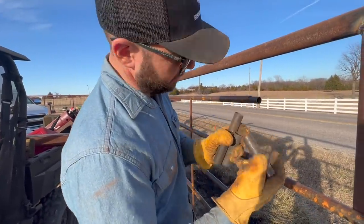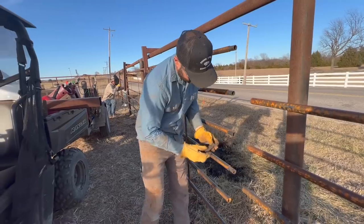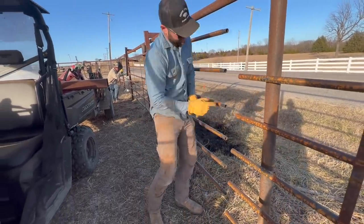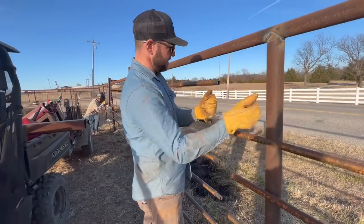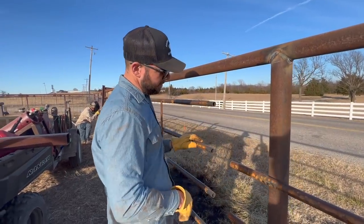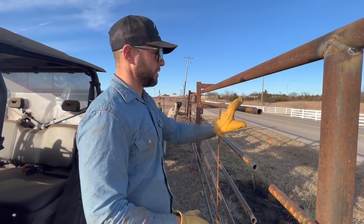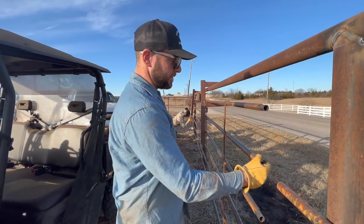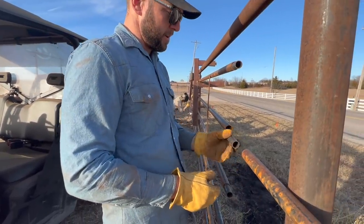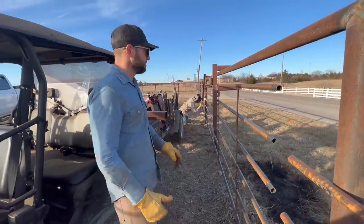Connectors come with a little bitty weld right here to keep it going in. Get them preset. So you put these in, you can slide the whole 20-foot joint down, and it'll bump that weld. We don't even weld it because we end up welding this to the frame, so there's no movement to it. Pretty easy to slide in and out. So if you need to match, you can kind of fit it in here to match your hole. Yeah. Works really well.